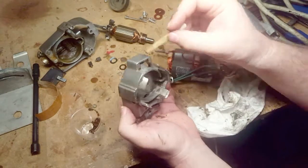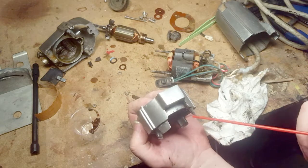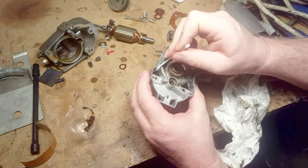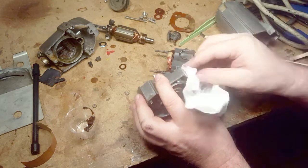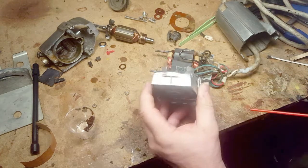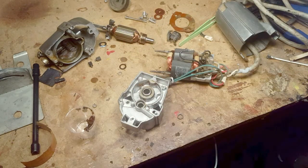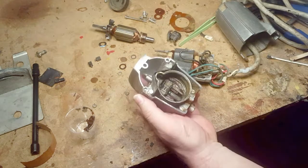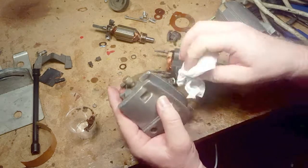The sawdust has gotten in through the front where the lamp is, so the whole body is open. I start wondering if it isn't open in order to get air moving through to keep the motor cool — but when I was doing this, that didn't even occur to me. There are little needle bearings in there; there's no way I would be able to get those out, and I don't want those needles falling out. So I've packed it with some grease and that'll hold it in place until it's all put back together.